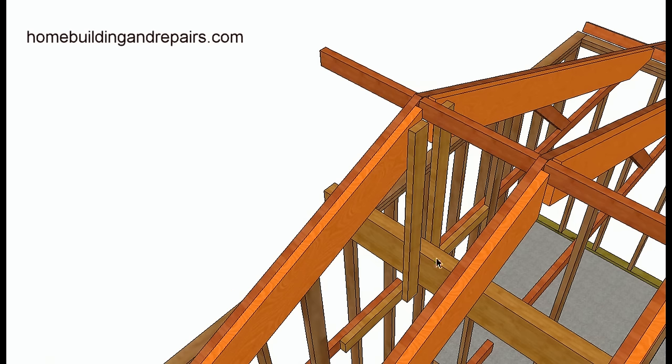Top view — I'm trying to give you different angles for a better idea. You might need to pause the video to examine some of these areas. This ought to give you an idea of how you can use the jack with a 4x4 or a couple of 2x4s supported underneath the beam. Any type of hydraulic jack will do fine. It wouldn't be a bad idea to put some type of strap on here — just a couple of screws in the post and the beam. I can't tell you how many times I've gone to raise a beam and then the whole thing falls apart once you start moving it around.